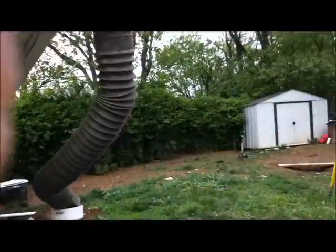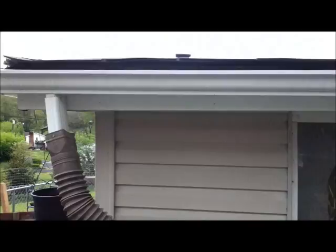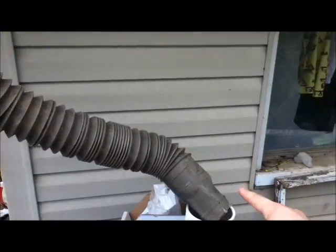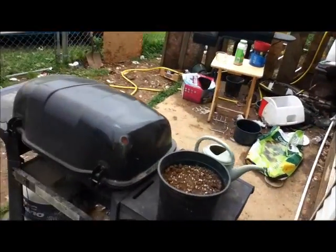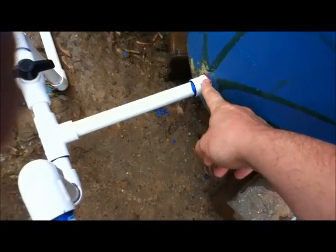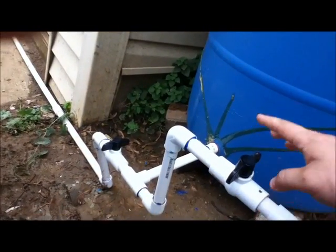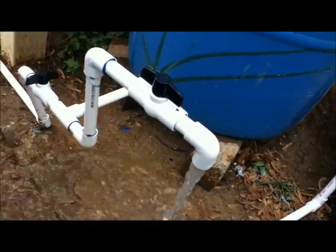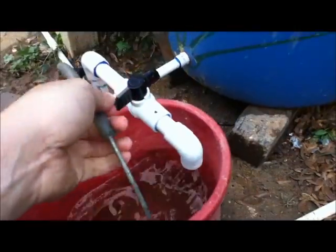I've got this hooked up to the gutter of the house. You can see the size of the roof — a lot of water comes off of there. It comes down here, and I've got these attachments right into the bunghole of the barrel — that's what it's called. I put a washer in here to keep it from leaking. I tried glue but that didn't work, so I bought a washer and that worked fine. As long as the water level is higher than this outlet, you always get water whenever you turn it on.